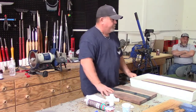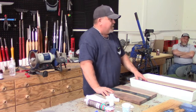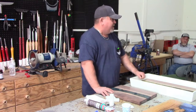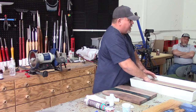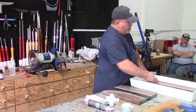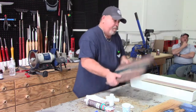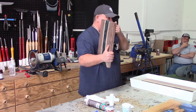If you're going to put LED lights in the resin — say a fairy light — I've never done it in a charcuterie board but we've done a waterfall desk. I don't like putting lights inside the epoxy because if the LED lights ever go out, they're stuck in there. We usually recess something underneath to place the lights inside. When you put them up close, you see the dots of the LEDs — you want that glow effect. A customer made a small piece of wood that went underneath, laying the LED lights on the side, giving a glowing effect without seeing every individual light.